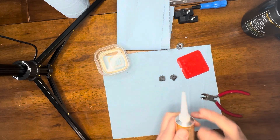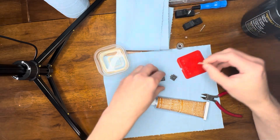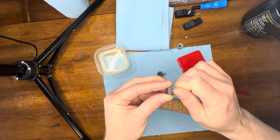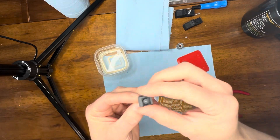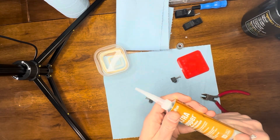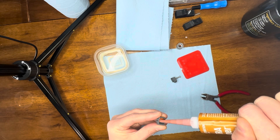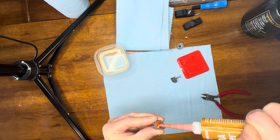Pop on the cap. Now what we need to do is grab the screw and thread it in so that it blocks the hole — we don't want any of the silicone to get into the threads, which is why we do this. It's not the end of the world since it's just silicone and it would come out pretty easy, but we'll do it anyway. It's also nice to hold — I can hold the screw. So now we're going to grab the RTV silicone and fill the cup, starting by filling in the void areas to make sure we get a nice good coat inside. This model has 45s on the side so the silicone should grip in here pretty well.